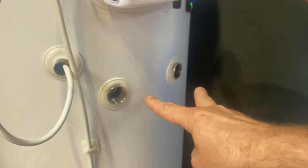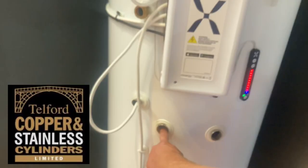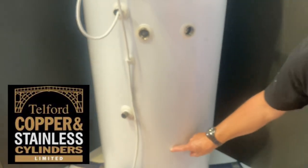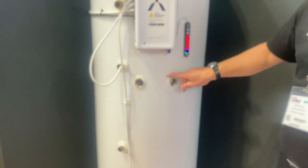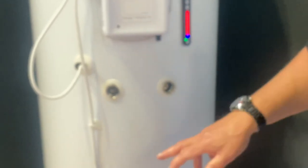So being technical now, that's for the heat pump. How come they're at the same level? What's different about the heat pump coil? The heat pump coil actually goes in there and then coils all the way down, then comes back up through itself and comes out at that point there. So we've got a three square metre 32mm coil in there, giving us a good corrugated surface and a good heat transfer.